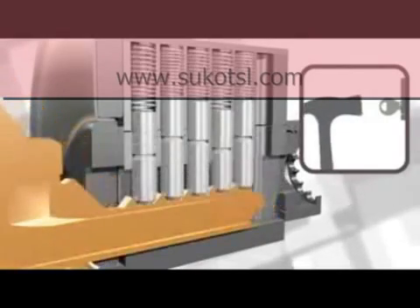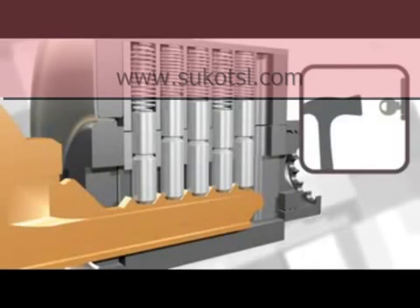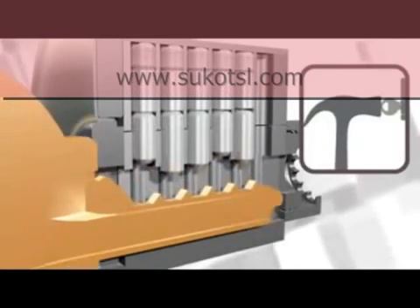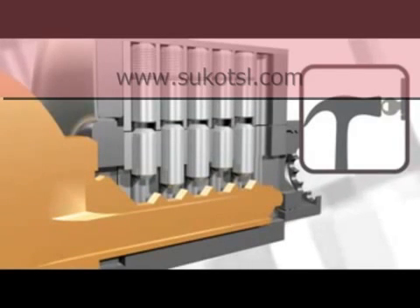Let's look at the action now in slow motion. The key impacts the pins, pushing them suddenly upward. The pins reach their apex, and the energy catapults the lower pins downward, opening a separation between the pins. As the separation crosses the shear line, the torque being applied to the key allows the cylinder to turn, opening the lock.